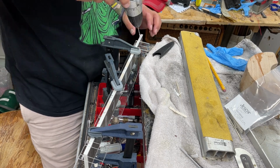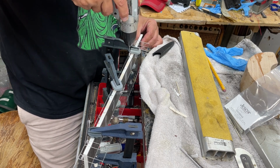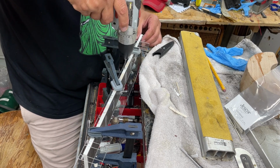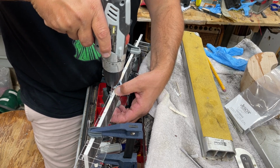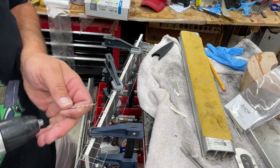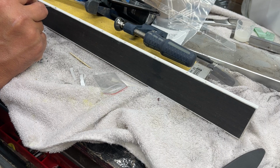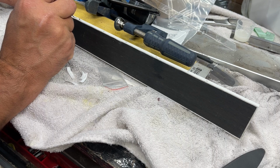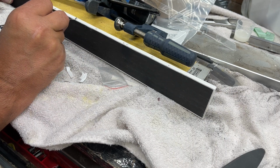And then we're going to make a jig to drill the side dots. I have a bunch of different size jigs, but Stewmac sells the abalone side dots. So we drilled down, got these all set up. A 3/32 bit, and we are close. We'll then take the abalone dots and drop them in. Got a nice little tool to push them down.